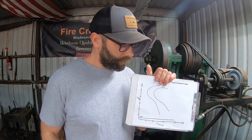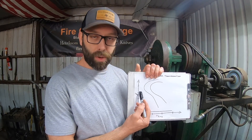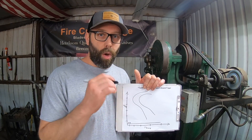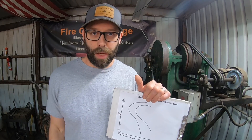On a very practical level, how do you achieve this? You could use a laser thermometer to check the temperature as you try to miss the pearlite nose for your specific steel. What I do in my shop is: I quench the blade until, when I pull it out, it's still smoking and still pretty hot — too hot to touch — but the oil on the surface of the blade is not evaporating within several seconds. It's still smoking, there's still a sheen or film of oil on the blade that hasn't evaporated off. That's how I make sure I've removed enough heat to miss the pearlite nose without too much residual heat for auto-tempering, while letting it slowly move down into the martensitic transformation.